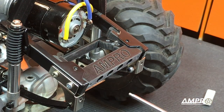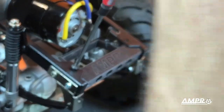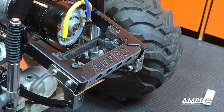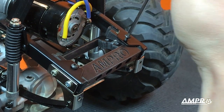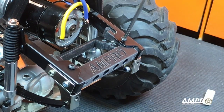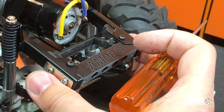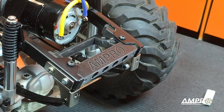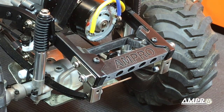For the top screw, the standard one will be fine. Note that when you are installing this, it's best not to torque anything down until everything is in. Oftentimes there's a little bit of play in these screw holes — not because of where the holes are placed, but because sheet metal is not easy to bend precisely. These two screws can be replaced with 16mm long M3 screws. Although 14mm would work, I still recommend the 16mm.